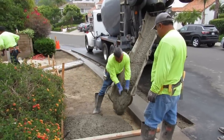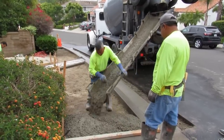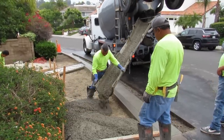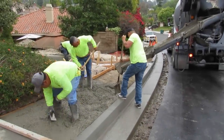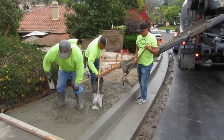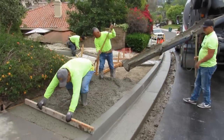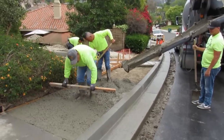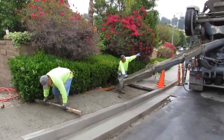We're shooting this down — also C3250, same mix on the sidewalk, three-quarter inch rock. I didn't have to bring my pump since it's right off the street. The neighbors were nice enough to let us use their hose and electricity since we didn't have any on site. There are potentially six more of these to do in the neighborhood because all these hillsides are flooding people's backyards and overfilling their pools.